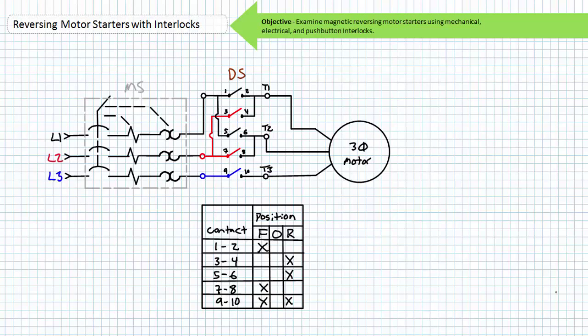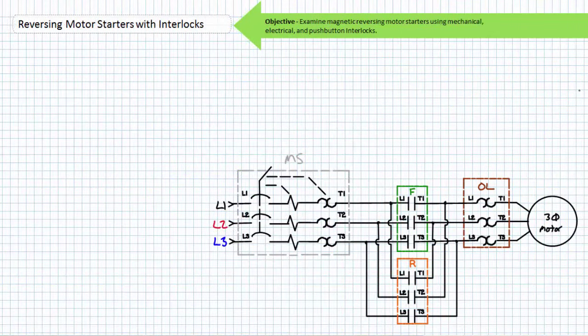This method, while appropriate for some applications, is clunky and inelegant in that the motor starter only must be used to make or break connections, not the drum switch. Drum switches are ordinarily not rated to make inrush current nor break full load current. An operator must be trained in its proper use. Additionally, a manual motor starter is for applications manually controlled by an operator at the point of use, limiting its applicability to situations necessitating nearly constant human supervision. It is for this reason magnetic reversing motor starters are employed.